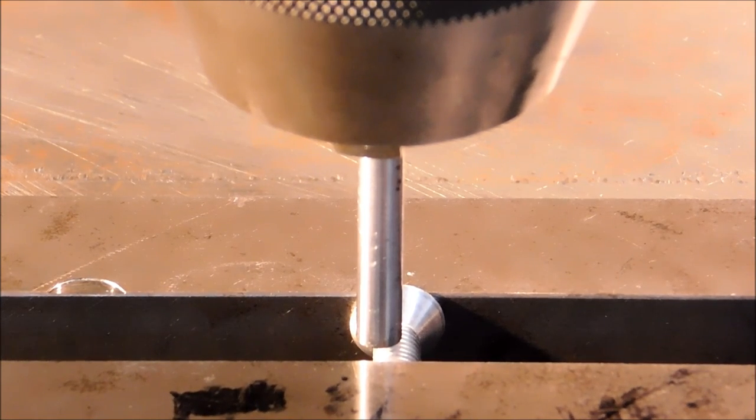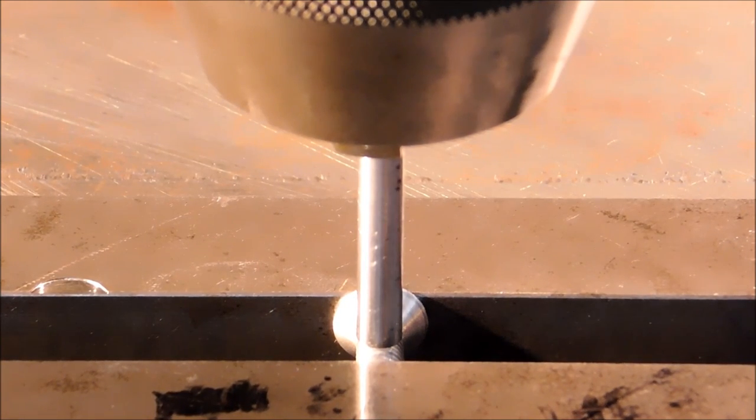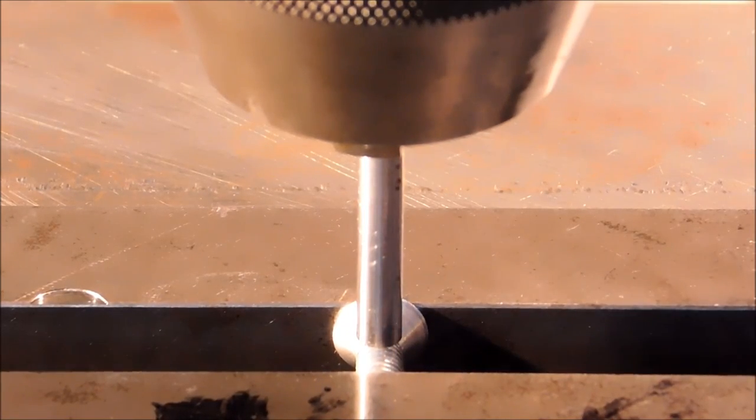The side-to-side alignment, all I want to do is line up the pin diameter with the diameter that I want to drill, and I'm going to call that my X0. Close enough. This is a half-inch long flathead. I'm going to go about 290 from the edge out, about 290. I'm not using stops. I'm going to repeat this operation for the next screw.